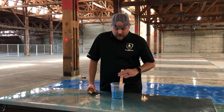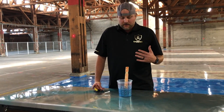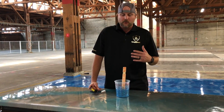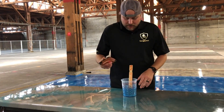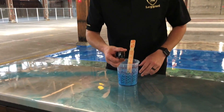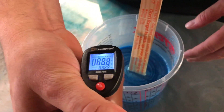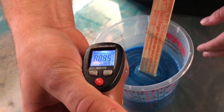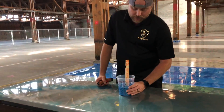It's been 10 minutes and it's already starting to heat up. This is a small amount — if you have a lot of epoxy in a five gallon bucket or a large amount, it's going to heat up even faster. So keep that in mind. We started out at 86 and we're at 105 now.